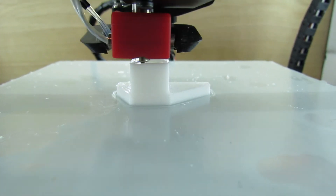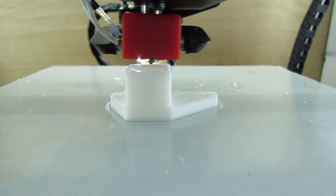After many, many attempts at cleaning up what is an obvious issue with PLA through settings and trial and error, I decided, you know what, let's go ahead and try it. So I swapped out my hotend the other day, and let me tell you, if you have the Flexion and you have the HT hotend for it, give it a shot for PLA. While it's true there was some more oozing and things I had to readjust for — I had to drop my temperature a little bit, or maybe actually raise it in some cases — what I have noticed is a much more stable printing experience. Things are working a lot better. I'm printing at a little bit higher speeds and I'm not getting the under extrusion problems.